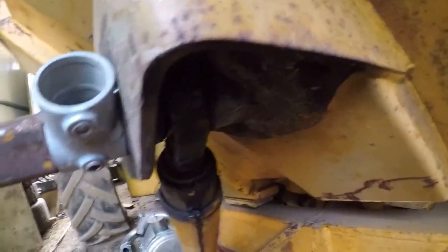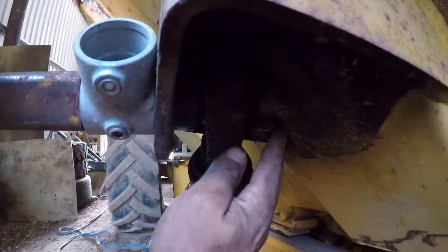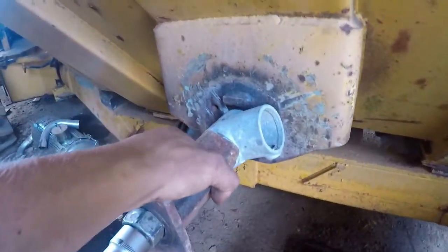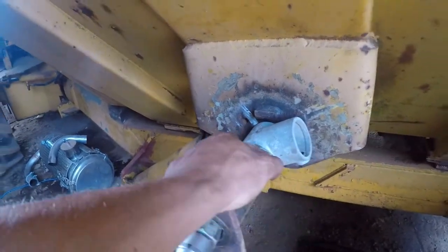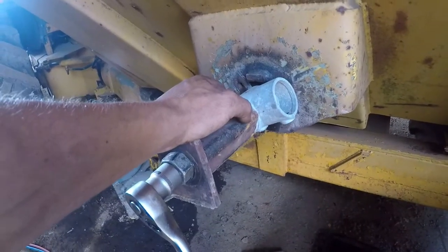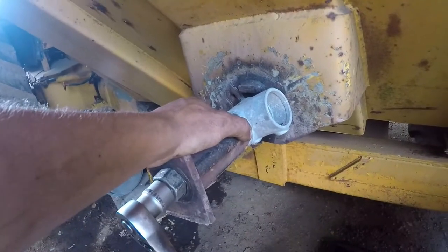Anyway, trouble is that lump is quite big, considering that lump I have to hit. That's the one it's really stuck in. I don't know if you can see it. Never mind. So the trouble is, by the time I heat this up and it gets red hot, the pin is hot as well. It's just too big of a lump, if you know what I mean, and they both expand the same way, so not much changing.